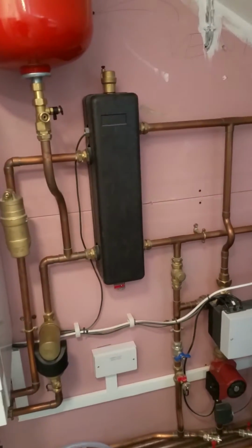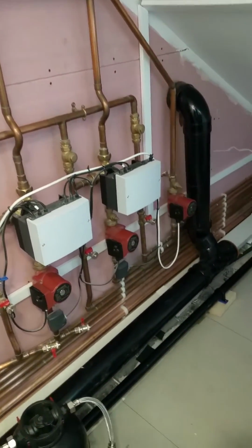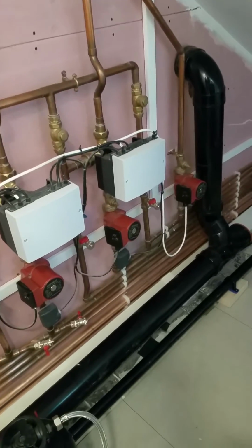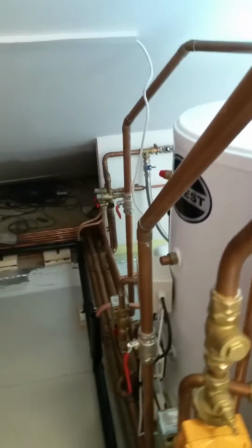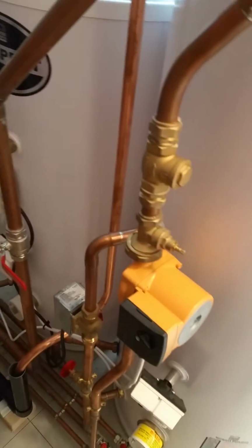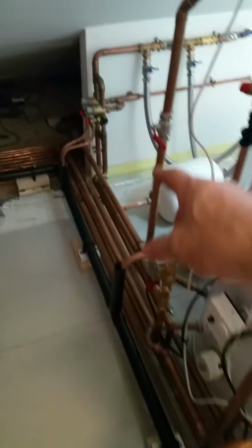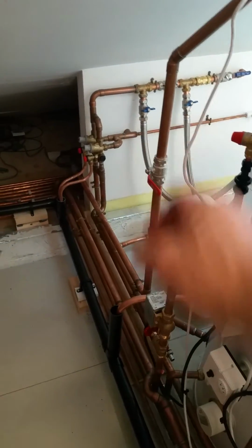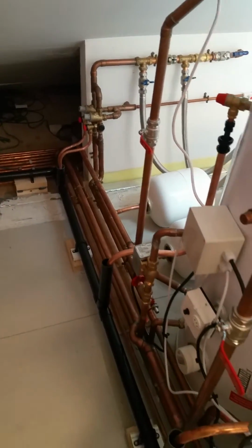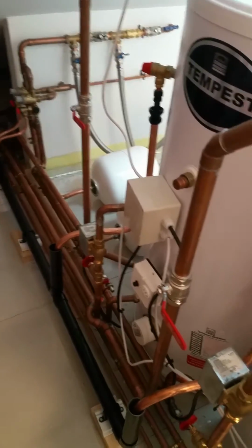Okay, job drawing to an end: Viessmann 200, hydraulic separation, 2 mixed circuits and 1 unmixed circuit, 2 unvented cylinders, not my choice, bronze recirculation, and combined, okay, a few noughties, combined pressure supplies here. So let's run you through the sort of theory behind my design.